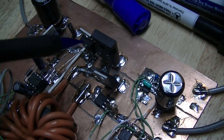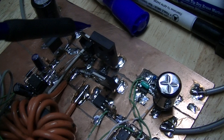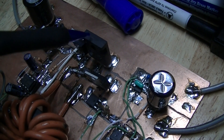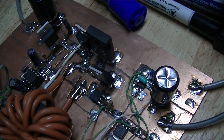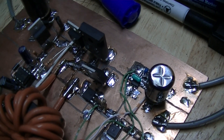It's about a volt or so potential drop across it, and at 15 amperes that would be 15 watts instantaneous dissipation. This Schottky is probably about 6 watts at most instantaneous and 60 milliwatts average — well under 100 milliwatts average dissipation.